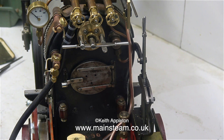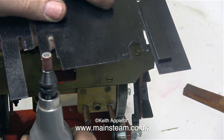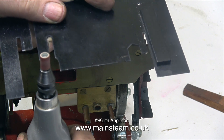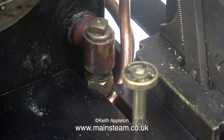So what's left to do? I think it's a good idea to test the system, but for a bit of suspense I will keep that part back until the end of the video. This is the trimming I was talking about on the footplate. Copper piping on a model steam engine must not touch any of the other metal parts — if it does, then with vibration, over time it's likely to cut through the pipe. And as you can see, this fits fine now.